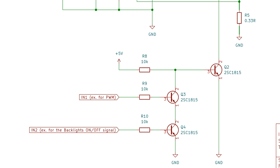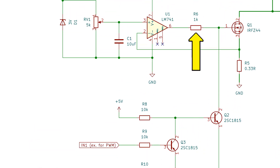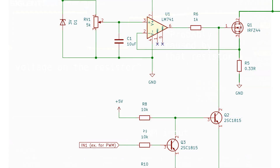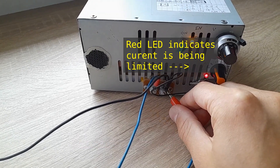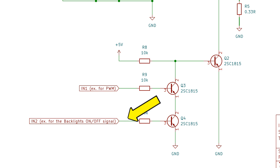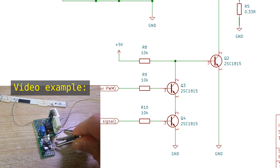The final part covers PWM and on-off control via a transistor that can pull the MOSFET's gate to zero volts. That's why the op-amp is connected to the MOSFET through a resistor — so the bipolar transistor can't short the op-amp output to ground. The downside is that the resistor and MOSFET gate form an RC filter that slows signals from the op-amp, which is bad for a fast-acting constant current circuit, but according to my oscilloscope it's fine. Connected to that bipolar transistor are two more transistors wired as a NAND gate. One input is the PWM from the monitor, the other is the on-off signal from it. Only when both inputs are high is the NAND gate output low, allowing the op-amp to turn on the MOSFET and the LEDs.